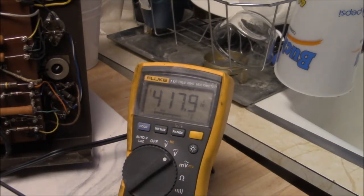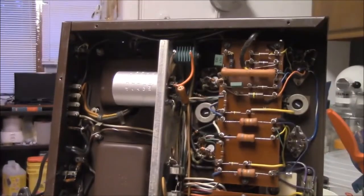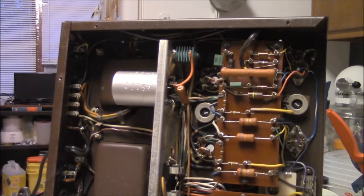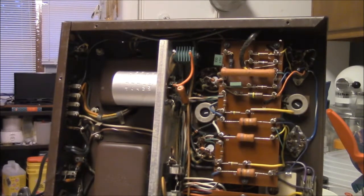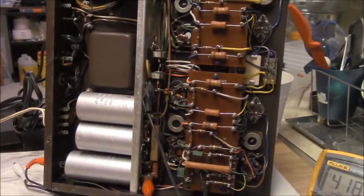One of the things I'm going to do is probably replace that selenium rectifier with an actual diode. It'll bump up the negative bias voltage probably a little too much. I'll probably have to put a little pot in there or adjust it or something. Realistically, I would really like to. This isn't mine, so I'm, you know,